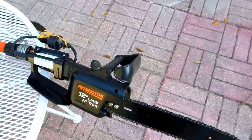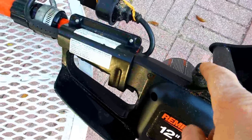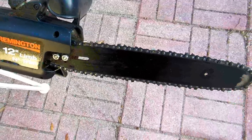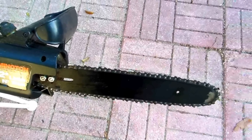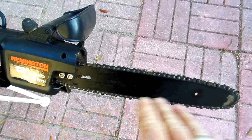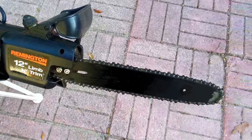This little saw will work like crazy. It has the oiler up here — a manual oiler. A lot of times I'll take a steel container with old motor oil and just dip the blade in it. As the blade is getting heated up, I'll dip it in there to cool everything down, and the chains will last forever. It's excessive heat and lack of lubrication that kills the chain.